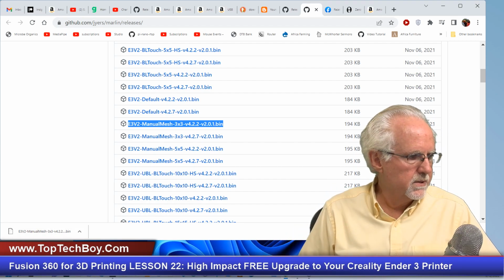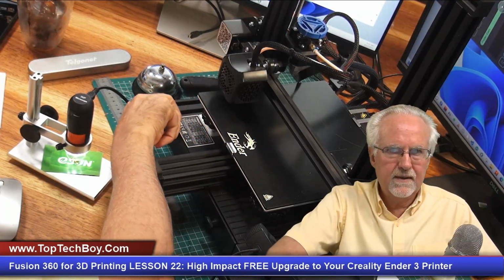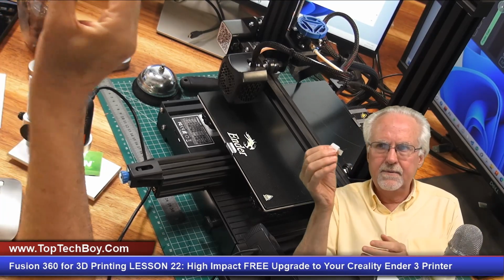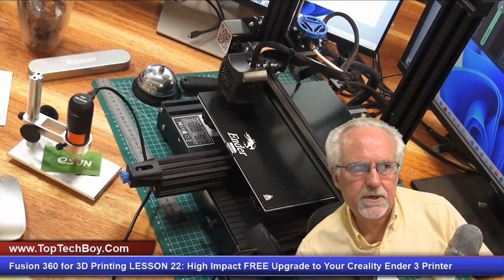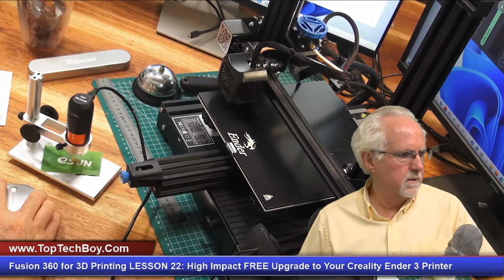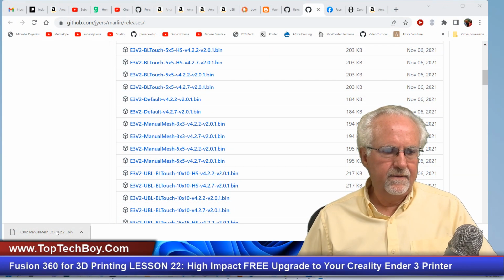Okay, now what I need to do is, my printer is off. Let's come back over here. I'm going to take the SD card out, and then I'm going to put the SD card in a little adapter. Now let me put the SD card down in my computer's USB. All right, with it down there, then what we need to do is we need to come back over to the view of my computer screen, and you can see that I have the firmware downloaded over here.